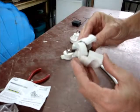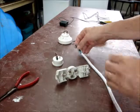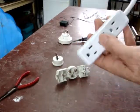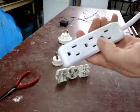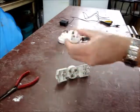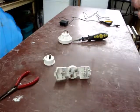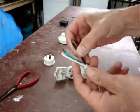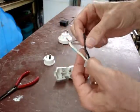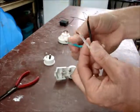Simple design — it just flips open each direction. Now, before you wire it up, there's something very important to note: you have to know which one is the power, which is the neutral, and the earth. In North American wiring, the black — or sometimes the red — is the live wire, that's the power. The white is the neutral, and the green is the earth.